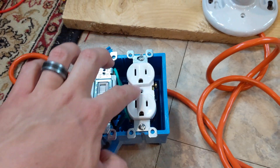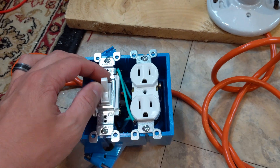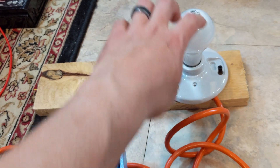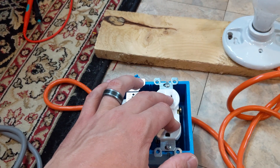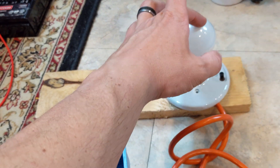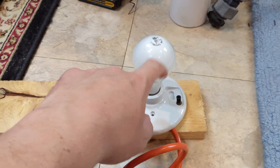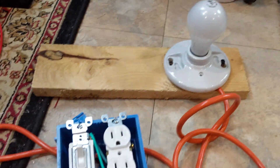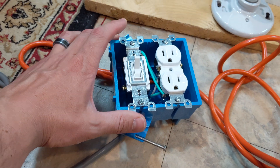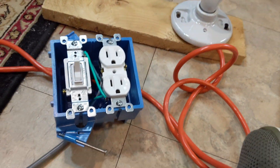You're going to plug your amp into one of these outlets. The current path goes: wall, switch, current limiter, and then to your amp. So if your amp has a dead short, the current is going to be limited by that bulb. It's a 60-watt incandescent — LED won't work. Uncle Doug uses like a 200-watt in his video; I'm using a 60-watt and it works just fine.